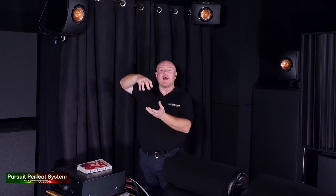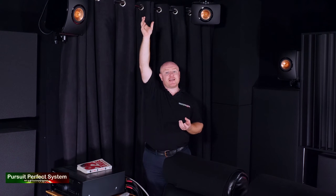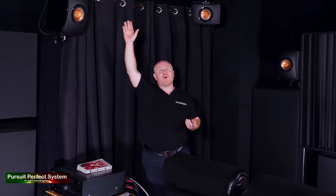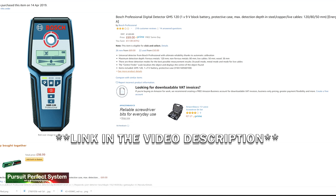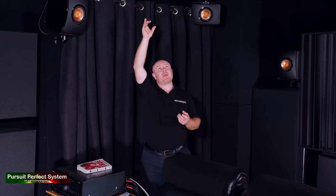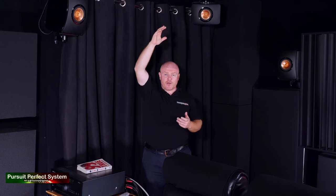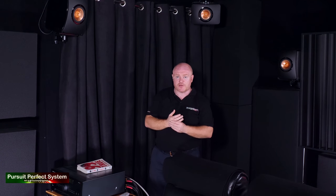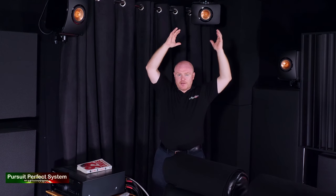To explain quickly how the ceiling speaker bracket works: it's one unit that comes apart into two. One part you screw into the ceiling — that's really easy. It's important to find a ceiling joist; I bought a Bosch joist detector from Amazon, a really high quality one because cheaper ones just don't work as well. You run it along the ceiling, find where your joists are — really, really important — so you've got a secure anchor point to hang the speaker from.